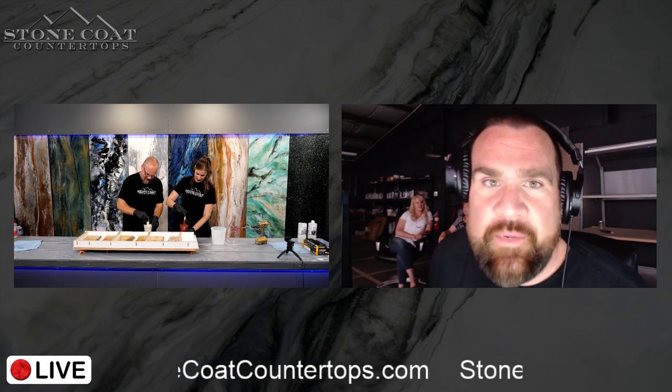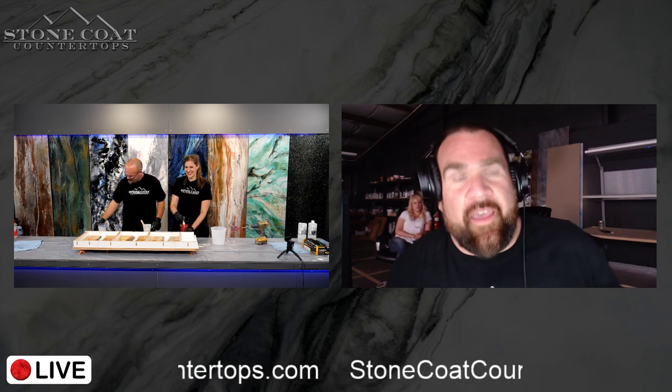All right, somebody would like you to invent bubble-free epoxy. I don't think that's possible, guys. Popping bubbles is very easy with a blowtorch, heat gun, even a blow dryer works. We tested that out in Florida. The air that gets into the epoxy may turn white on smaller batches. Just use a torch, blow dryer, or heat gun, a couple passes, and it clears right up.